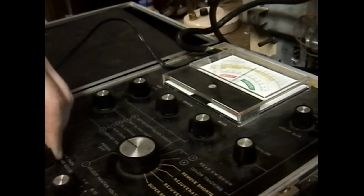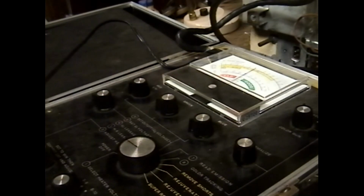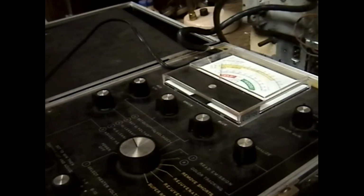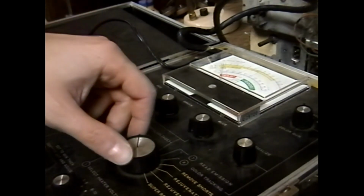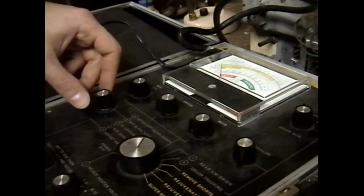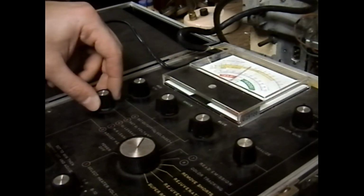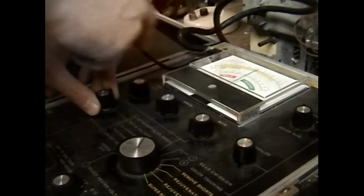All right, well, adjust the heater back up to 6.3 volts and hope that it's somewhere in the ballpark. Now that we actually have our isolation transformer isolating. Okay, HK leakage is now not a problem because there's no path, because the heater has been isolated with that booster. Let's just set G1 voltage to the little green mark here.